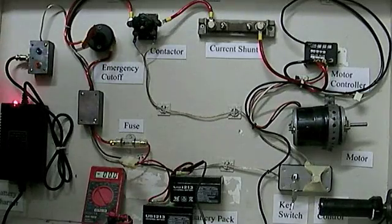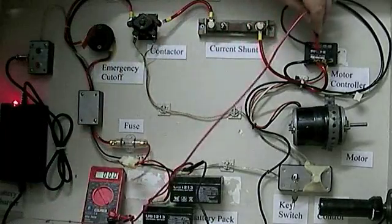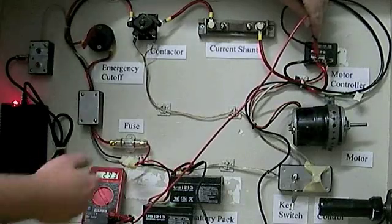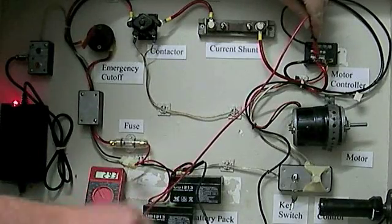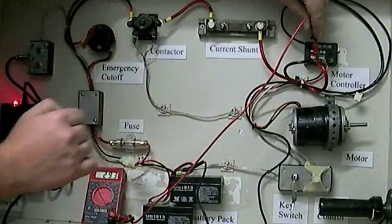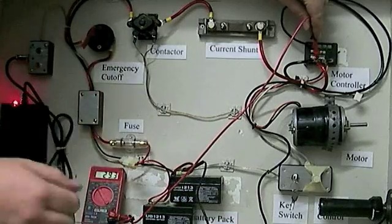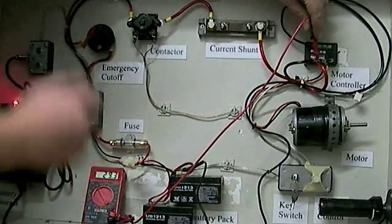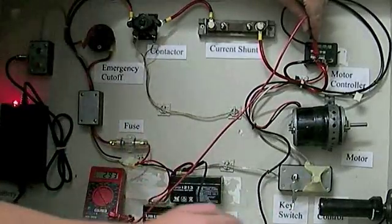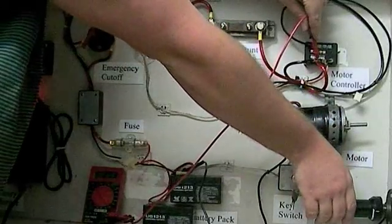We can see some of this functioning at work. Taking a battery measurement at our controller — it was 29.3 before, still 29.3. As we apply more and more load to the motor, it's going to drop the voltage down a little bit because it makes the batteries work harder. It's a chemical reaction passing current out through its plates, causing a voltage drop. I need to position the meter so you can see this on the display.